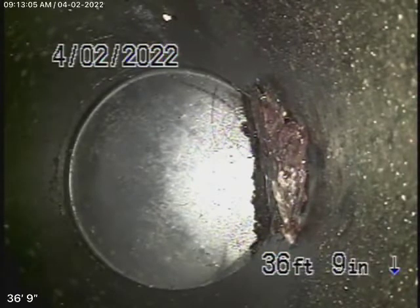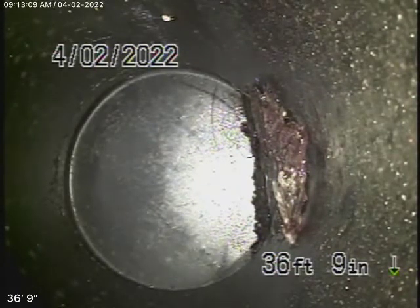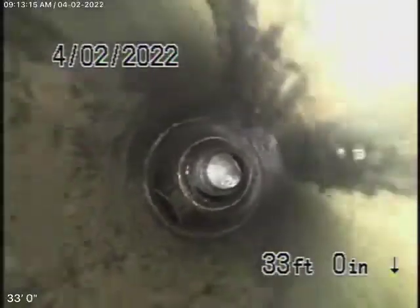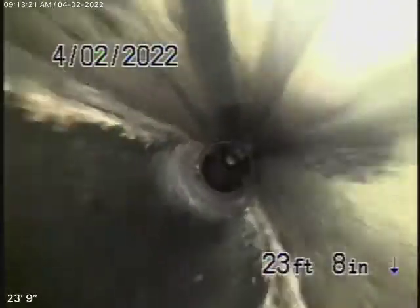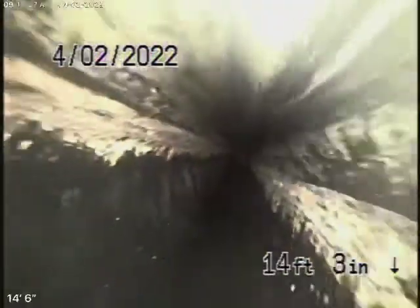Running the camera upstream now. We've come to the end of the line from the two-way clean-out. It's ABS plastic over here, all in good condition. You can see the connections along the way. The best thing to do is definitely have the general inspector crawl underneath and make sure all the branch lines are in good condition — hopefully they're all ABS plastic.